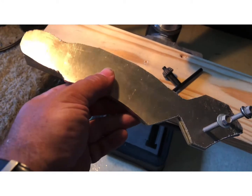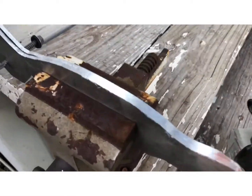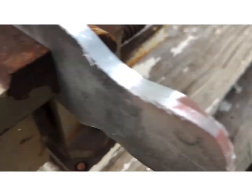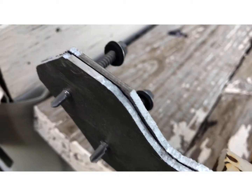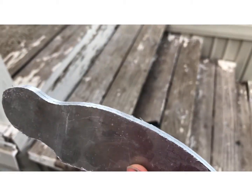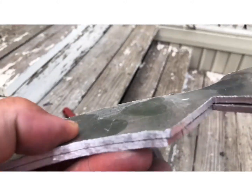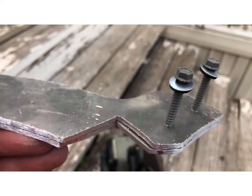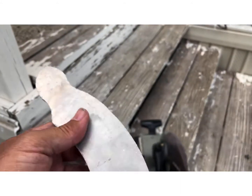This is starting to take some shape — can't wait to get it done. I'm using a belt sander to sand this down. I can't show you and use the machine at the same time, so I'll just show you: before looks very rough, but after looks very good. Still got to keep going, but just wanted to show you how I'm doing it. Most of this is done — 99% of it. All lined up and level. The only place I could not do with the belt sander is where it's got the straight cut — I will need to do that with a hand file. Everything else I'll finish up with a hand file to make it prettier and round the edges off so it's not so sharp.